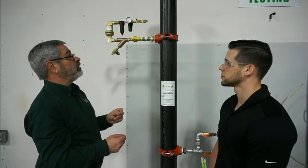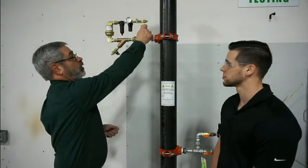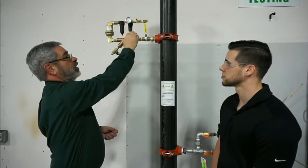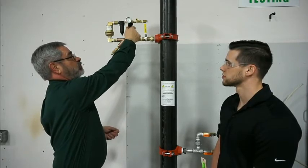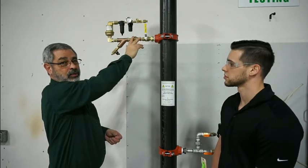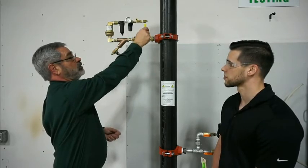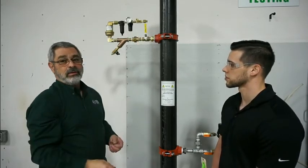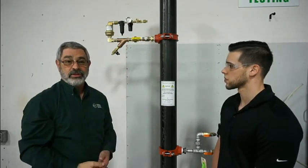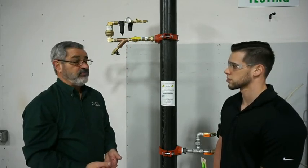What we need to do is adjust the regulator. To do that, we're going to open the ball valve and close the ball valve and watch the gauge decrease down to the lower alarm point. If it doesn't, pull down on the cap and turn it either to the left or to the right to raise or lower it depending on what you need. Once you get it set, close it and check it one more time — open and close. Once that's done, to start the inerting process, open the ball valve and come back 14 days later and close it. At this point, we have completed the commissioning of the nitrogen generator and the vent.